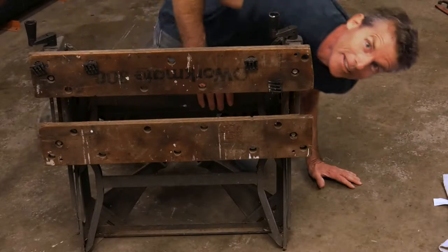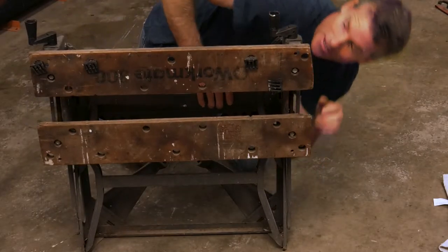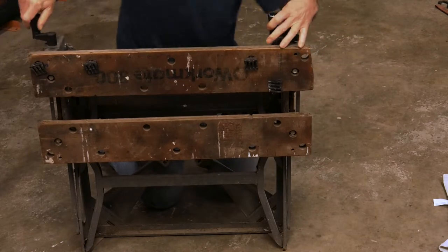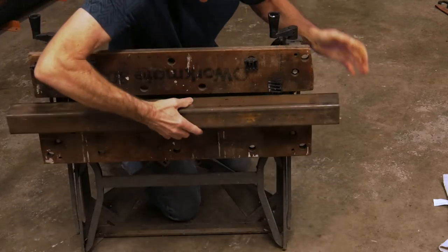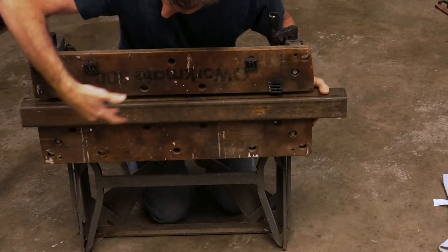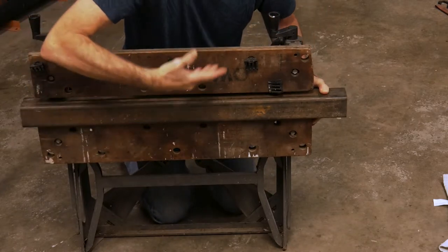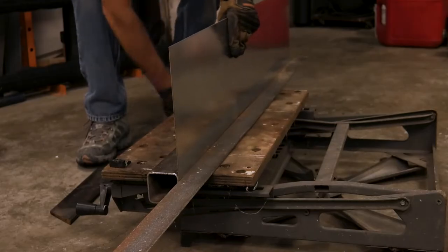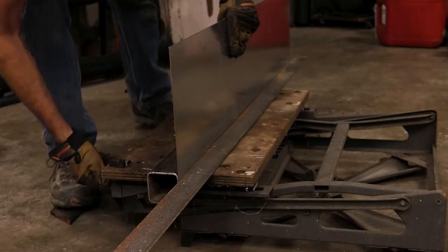Now, I don't have a brake, which is a tool that you use to bend sheet metal, so I'm gonna have to improvise. So I have this portable workbench that has a table that clamps. So I'm going to clamp the sheet metal in between the tubing and the angle iron. One thing that would have been nice is if the square tubing was 4 feet long, I could have clamped it just once. Well, since it's shorter than the sheet metal, I'll have to move the sheet metal back and forth a few times, aligning up the edges.